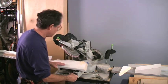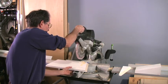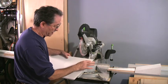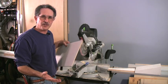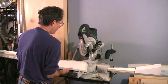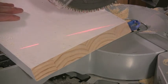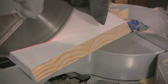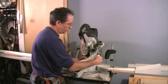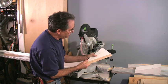That's the first one. To get the second one, all I have to do is relieve this piece right here. I'm cutting one off with the face on this side of the material, and this one is going to have the good face on it, but they're self-returns — they're not going to show that much. Plus it's paint grade, so it doesn't matter which side of the board ends up face out. I'll line this one up with that laser line right on the short point of this piece. Those are the two self-returns.